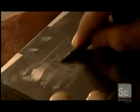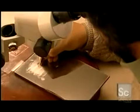Now he tapes the scribe sheet onto a piece of soft steel. He lifts the sheet and coats the metal surface with beeswax. Then he lays the sheet down again, and rubbing with the burnishing tool, transfers the scribed image to the wax coating. Now, under a microscope that magnifies the image 7 times, he etches the design using what's called a pointing tool.